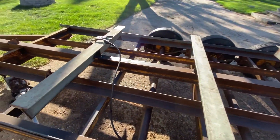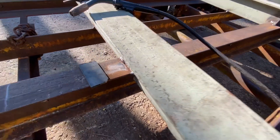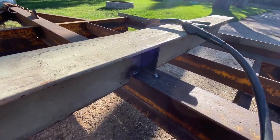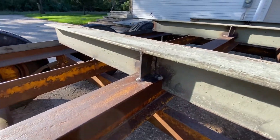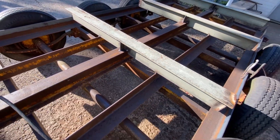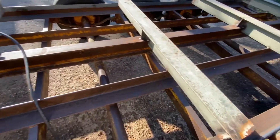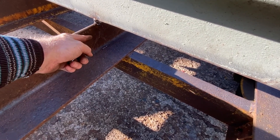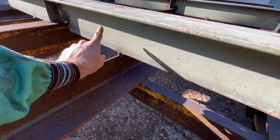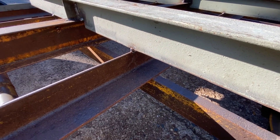I'm almost done with the next thing I'm doing here. Basically I'm just welding these gussets in here to give these a little bit more stability. On my last one here, just welding all the way around. This thing might be overkill, but better overkill than underkill. I also plan on welding a two-by-quarter piece right here. I'm not sure if I'll go this whole length from the top all the way down or not, but I might — it depends on how much material I have.